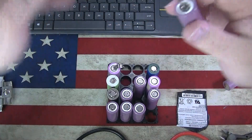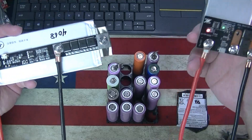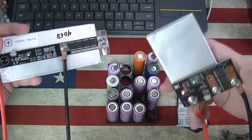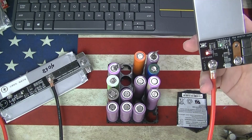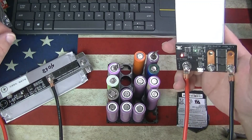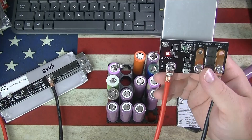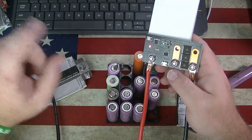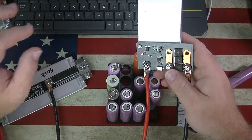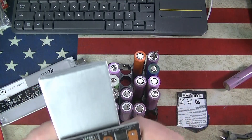For conclusion, what we have here are two inexpensive all-in-one battery spot welders that will weld 0.1 millimeter nickel strip. If you're just building a little battery bank for charging your phone, swapping out 18650s in your earbuds, or doing any small battery project like solar lights — this is a good way to go. I would even build my power wall with this. If I were building a power wall I'd go with the red welder — no problem, 0.15 nickel strip all day long. As I use the KWeld and it gets hot, I might swap in the red one to give the KWeld a little break.